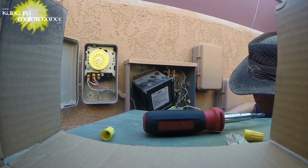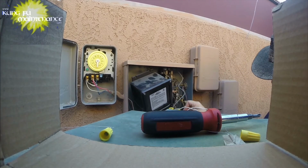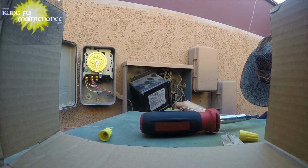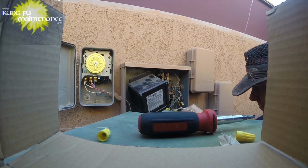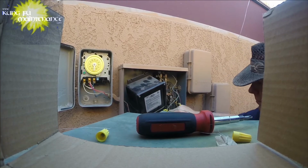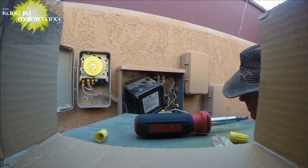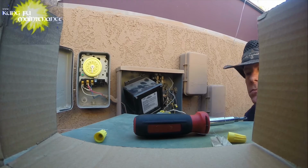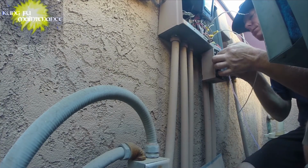So it takes the path through the GFI, from the GFI to the bus bar. But when the GFI cuts off, it's separate. So both its hot and neutral load are completely separated. And that was the mistake here that caused the whole rigmarole of someone wiring it backwards and doing everything to overcome what was there, which was the neutrals all being connected together.